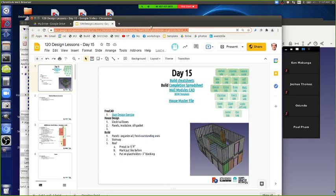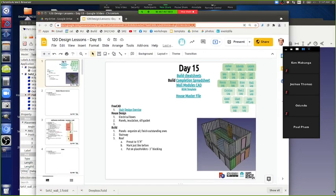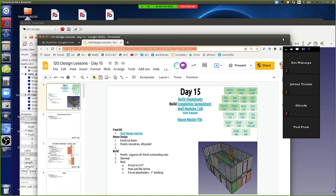Any other questions on this? Once you start seeing this and touching this and actually building this, it'll become more obvious. On this wall detail, the modular utility channel did take some thinking, because you have to consider how the codes work, how our modularity works, how the interconnection works, and that you're not puncturing wires. There's quite a bit in there. Once you build it, it's very transparent, but before you get to it, it took us a little bit of time to arrive at this. I can't say I know anybody that does it this way. As I said, the standard is holes through the studs, and other than that, no innovation has happened over the last century, so I haven't seen other people doing this yet.